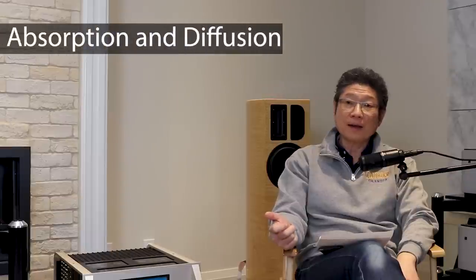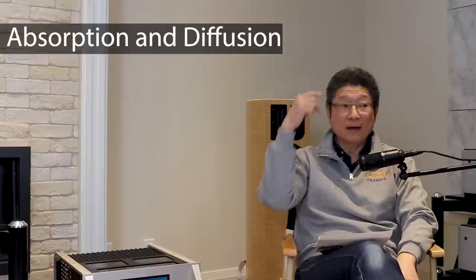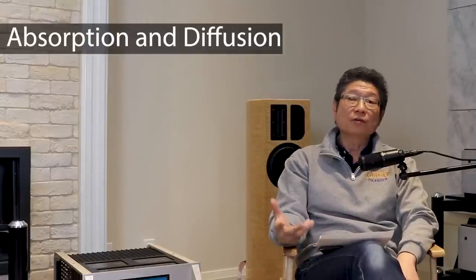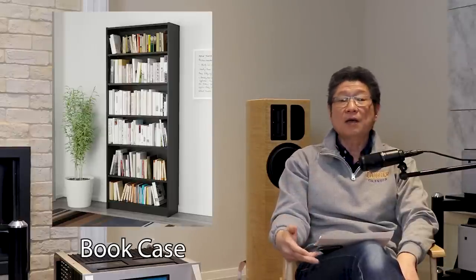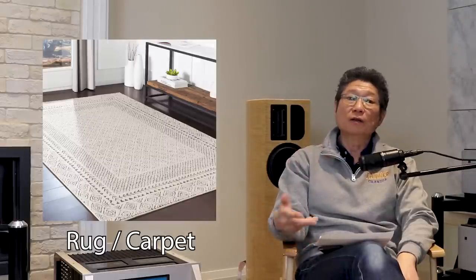So there's basically two parts. There are more, but the two simple parts of acoustic treatment are absorption and diffusion. For most people, if your room is too bright and echoey, consider some form of absorption, which is basically to take the energy that's rattling around in your room and kill it. There are a number of ways you can do that. The simple, inexpensive way is to use natural stuff that you would put in your room, like, for example, bookcases. Buy a rug, bookcases, stuff that you would decorate your room with,